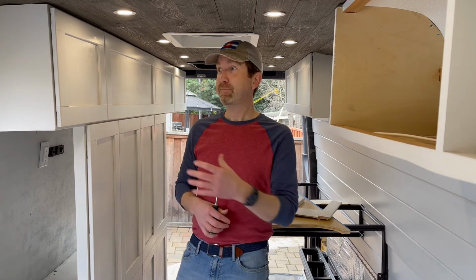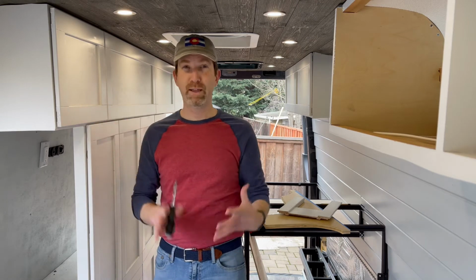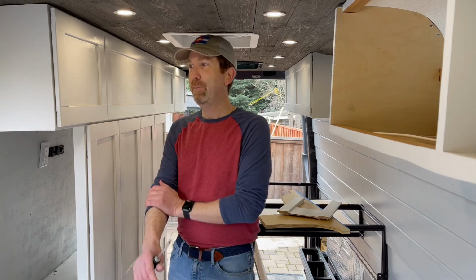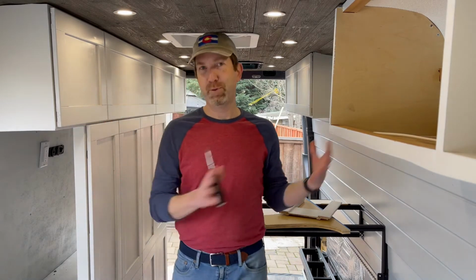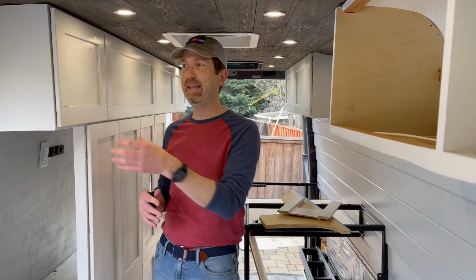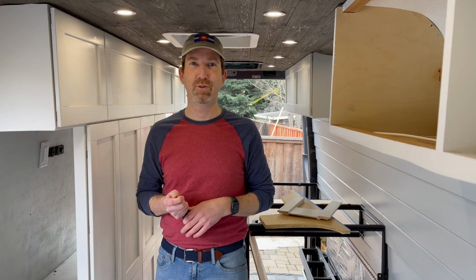Okay, now things to be cautious of or think about. So I did 1/2 inch. This is solid pine. It worked really well as long as you get the depth of everything. However, because it's only 1/2 inch, it rippled into every other decision that I had to make with this. Case in point, the Blum hinges, as I talked about, traditionally come for 3/4 inch. So just be aware when you make a decision that differs from the standard, you might have to come up with creative solutions to implement something.